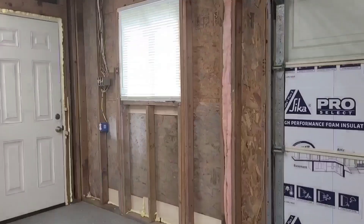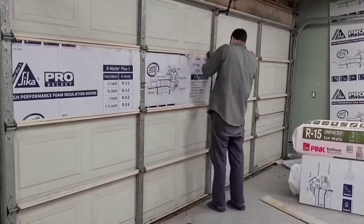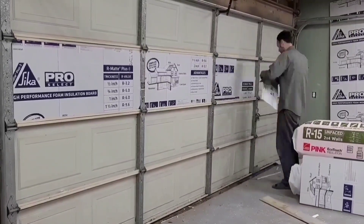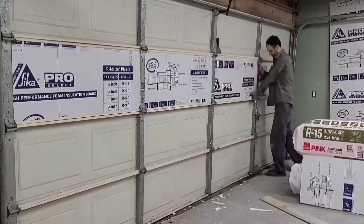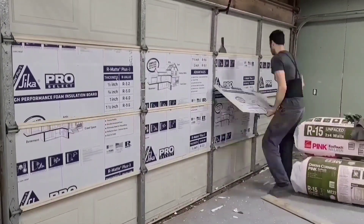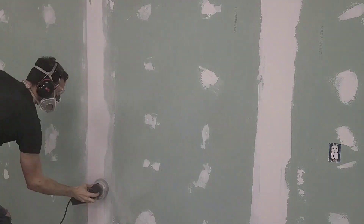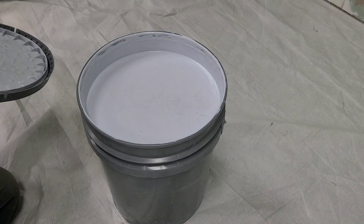I did insulate under the stairs to keep the area with the two-stage compressor cool — it's going to produce a ton of heat leading to water vapor in the line, and I don't want the filters working harder than they have to. For the door I used a high-performance foam insulation board from Home Depot. A standard door allows for an inch and a half of insulation, but Home Depot only sells half-inch or one-inch, so I split it into four pieces to maximize coverage, then slid the second piece up, pushed it in, and slid it back down to lock it. This mud shot will look familiar to anyone subscribed — it was the Goldblatt drywall taping knife video, and this was the real shot of the tool being used immediately after the restoration.